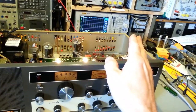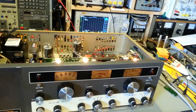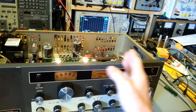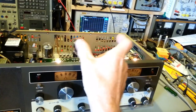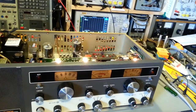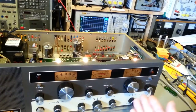You're not looking at a watt meter where, yeah, you've got power, but you have no idea where it's actually being transmitted. A spectrum analyzer allows you to see where in the frequency span it's actually at. And depending on where you set your bandwidth limits, you can see harmonic energies. On channel 19, you could set the spectrum analyzer for a center frequency of 54.37 megahertz. That would be exactly two times channel 19's frequency, or the second harmonic.